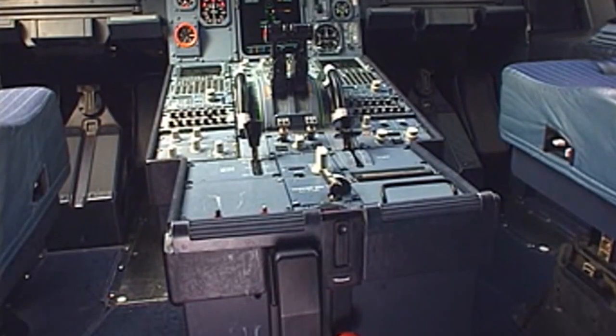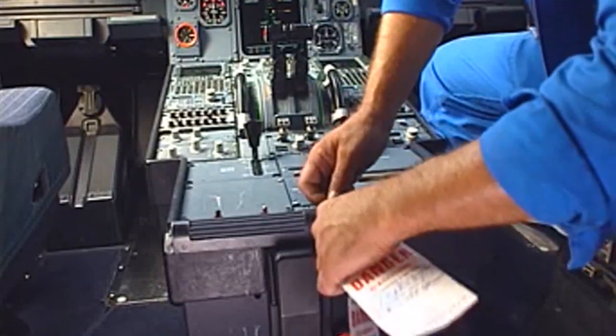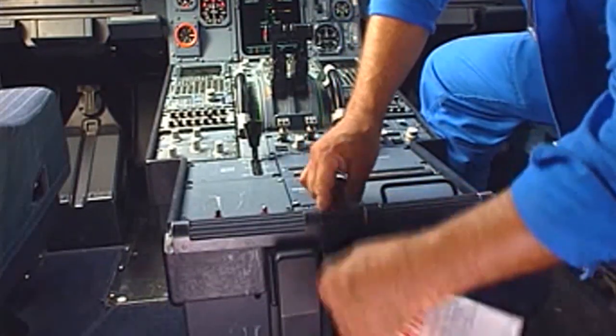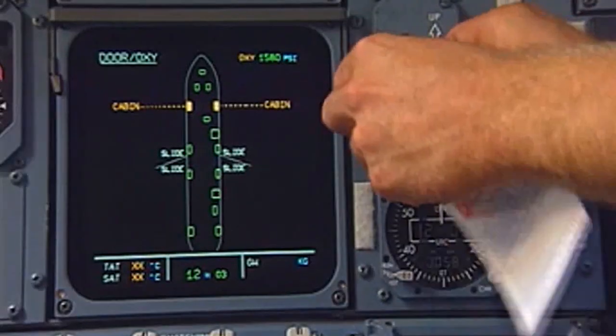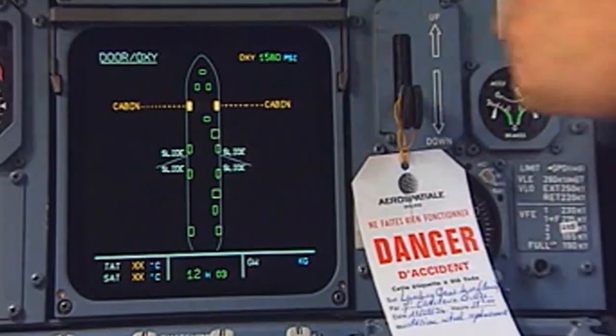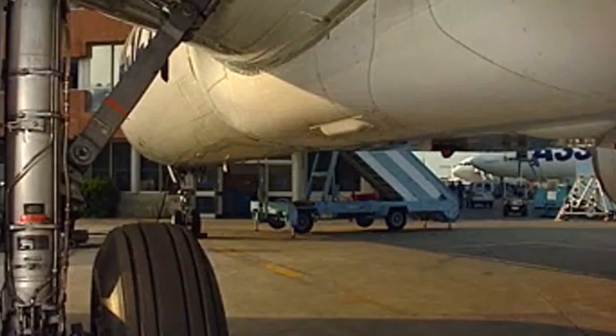In the cockpit, put warning notices on the free fall handle and on the landing gear control lever. Make sure that the green hydraulic system is depressurized. Outside again, make certain that the door travel ranges are clear.